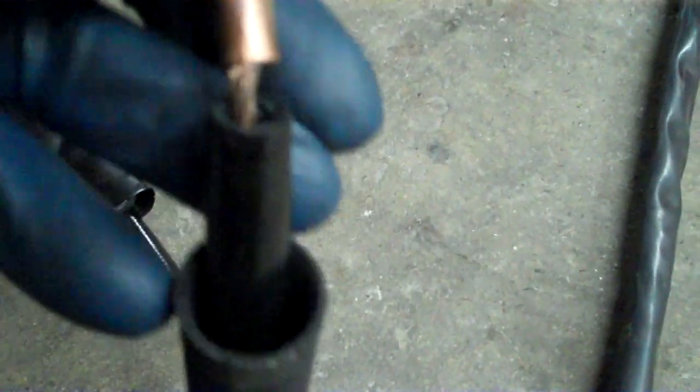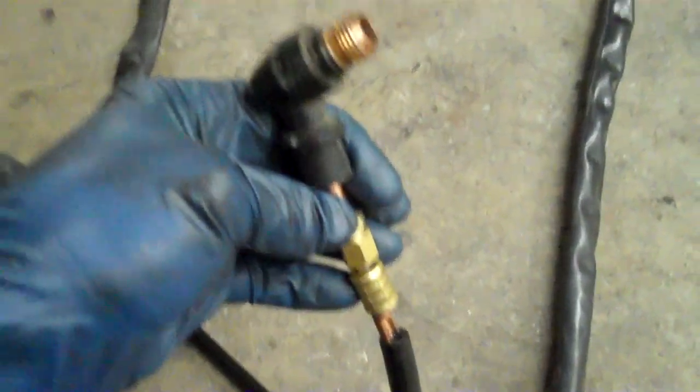That's my guess anyway. Because like I say, when I first got it, it was working okay, and then it just got to where it was just bad. I'm hoping this is all that it was — just that this clamp came undone. This may be from the process of taking it apart; I don't know for sure yet. But I'll clamp this more securely and see if that takes care of the problem I was having with it not having a pilot arc.